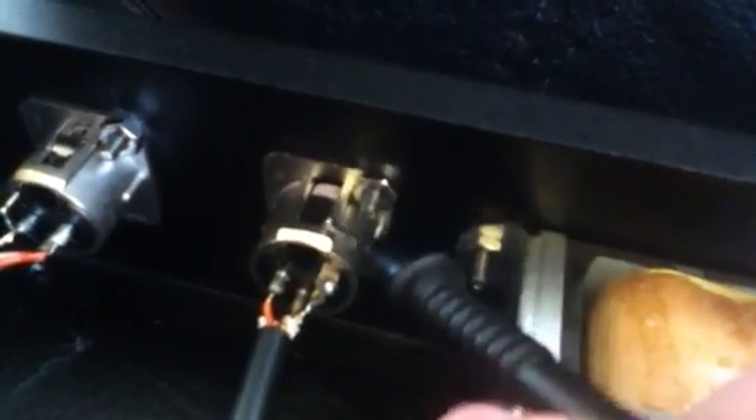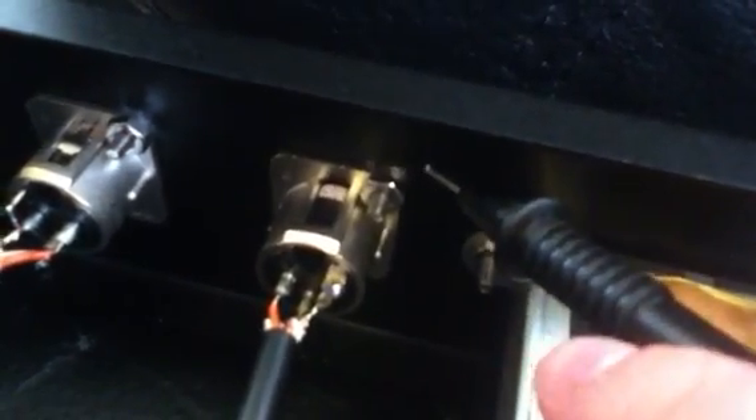So the chassis is complete, acts as a ground shield. There are some ground components that need to go into the chassis itself. For instance, the XLR — you need grounds. The ground pin, pin one, needs to be grounded into the chassis. I have a wire going from pin one grounding into the XLR itself. I have bolts here and I scraped off the powder coat on the chassis to make sure the connection goes right into the chassis at the XLR. So this XLR is tapped in and grounded into the chassis.